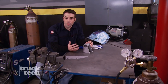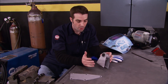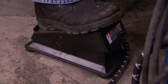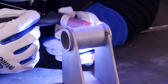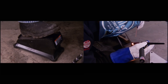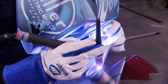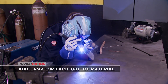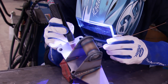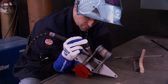Welcome back to the shop, where we're in the middle of making engine mounts so we can place our EcoBoost V6 down in between the frame rails of our old 55 F100. All the parts that I had mocked up went ahead and got sandblasted to get rid of all the mill scale, and now I've got some TIG welding to do. After tack welding the tube to the plate to make sure things don't move around on me, I can go ahead and fully weld the mount. A new addition to our welding arsenal is this wireless foot pedal — just one less wire to get tangled up. I'm using a 1/16 tungsten sharpened to a point, a 1/16 mild steel filler rod, and about 120 amps to get the job done. A good rule of thumb is to use 1 amp of current for every thousandth of material thickness you're working on. In our case, the tube has a wall thickness of 120 thousandths, so we're in good shape. To weld the 3/16 inch thick side plates to the base plate, I'll turn the current up a little bit if necessary.